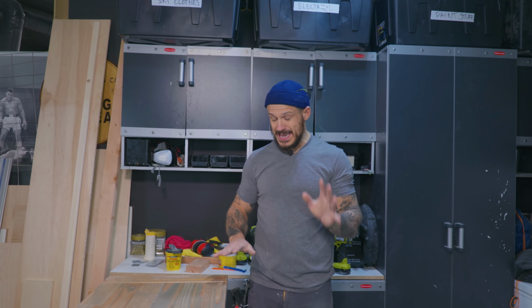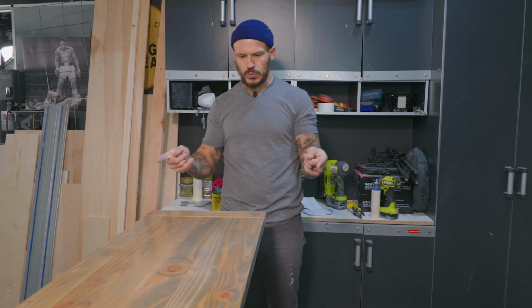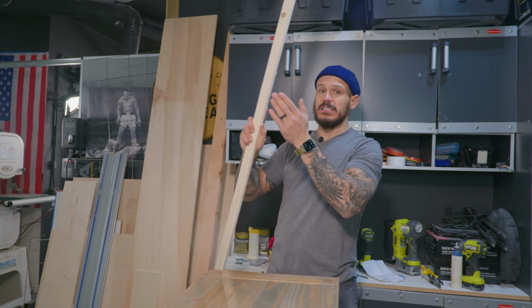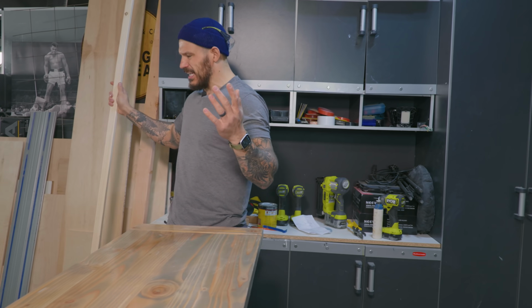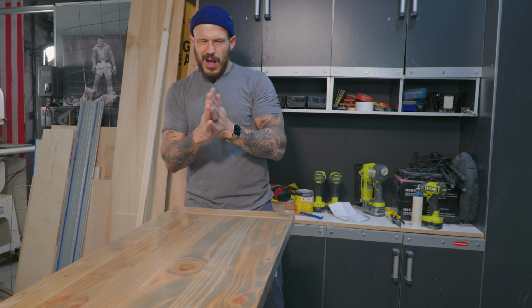All right, so the epoxy cured nicely, nice gloss finish, very bar-like. Okay, so here's what's gonna happen. Everything's wrapped. I am gonna sand the plywood just because it's gonna be easier sanding now, which leads me to the next step, putting on the trim pieces, 1x2. We bought the cheaper bundle stuff, which is inexpensive. Brad nailed it on, give it a nice X farmhousey pattern.